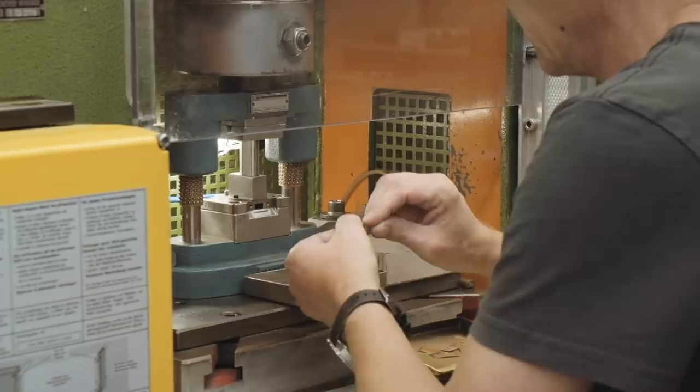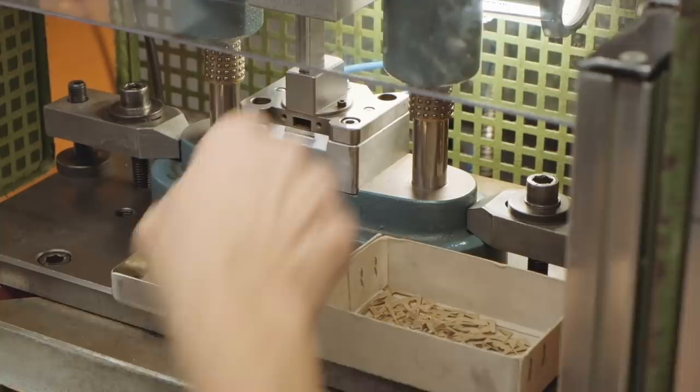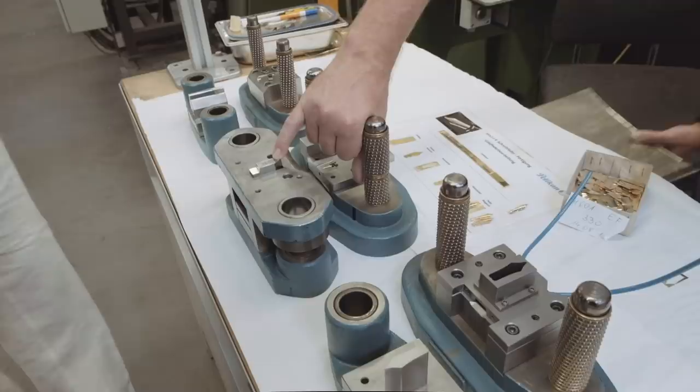The waste of cutting the nib obviously will be recycled. As are the other processes of the golden nib production, also this is done by hand, piece by piece. After the shape of the nib is cut, the embossing of the famous Pelikan nib design is done. With the embossing, also the gold marks are placed on the gold nib.